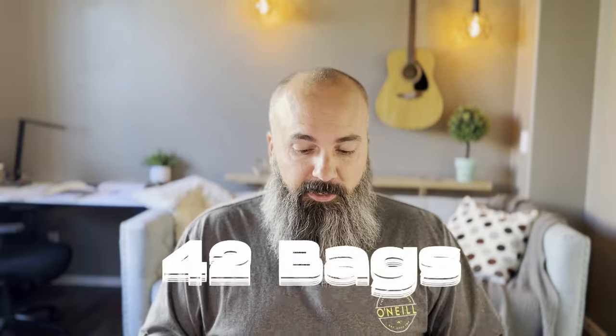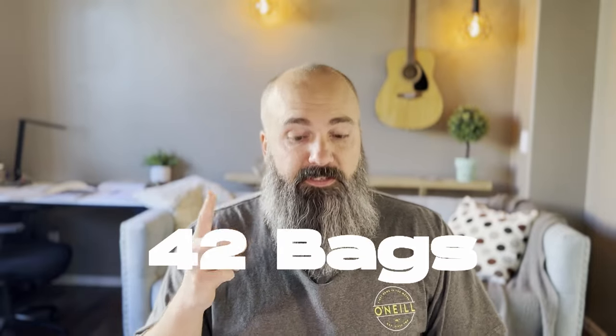Once we were about halfway through the project we weren't sure how many we'd need, so I guesstimated 16. We wound up using only seven of those 16, and since I had the blower machine, I figured there was no reason to take the other nine back for $160 — I'm going to put them in the attic. Originally I put 42 bags in the attic at $675; now there's 51 total. I have an R21-rated wall now because it's a 2x6 wall packed as tight as I could get it, and my ceiling is somewhere between 8 and 10 inches — I'm calling it R30.